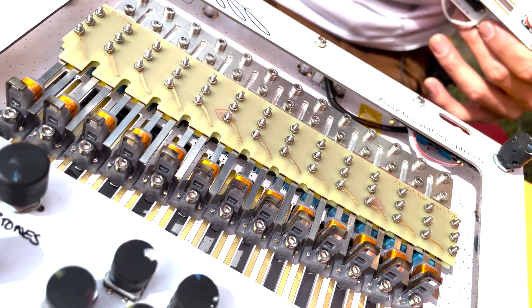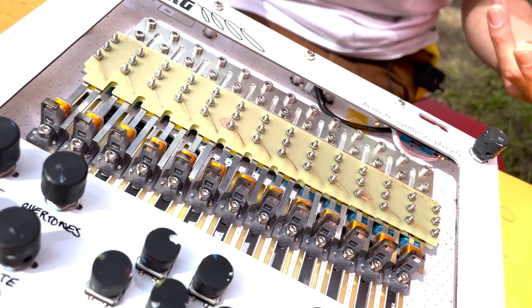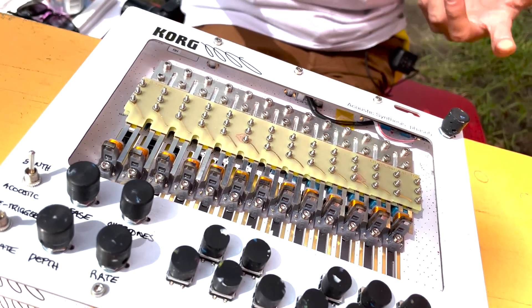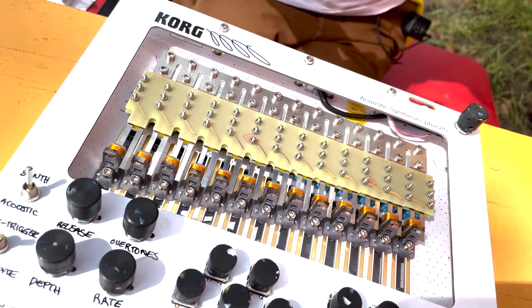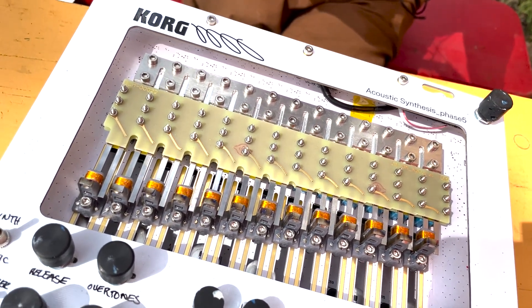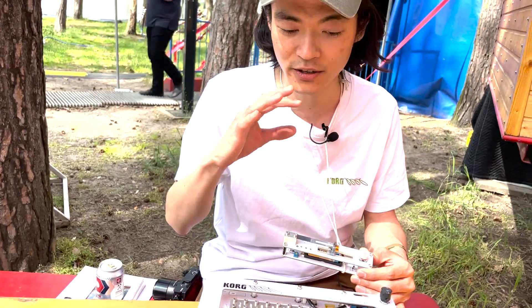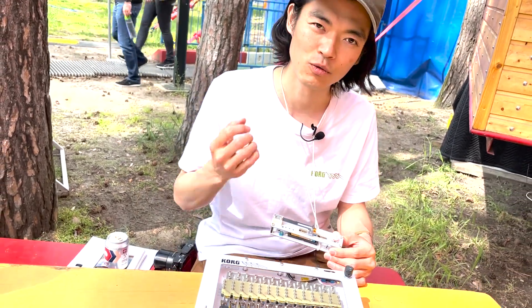We pick up the vibrations using this capacitive pickup, which is designed to capture the rich tonal character of the resonator. That can be used as-is, like in an electric guitar or electric piano where you have pickups on an acoustic instrument. But what we do differently is we listen to what the resonator is doing and use a feedback control system — we can say we want more of the fundamental, more of the first harmonic, or the second harmonic. We can even put an LFO in and modulate the harmonics individually, turning it into something you'd see in a regular synthesizer with envelope control and different modulation options.